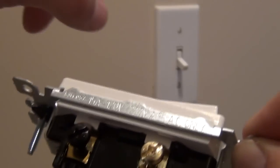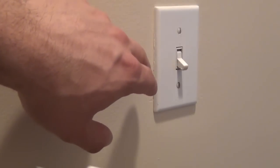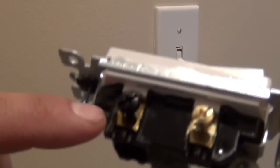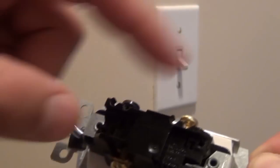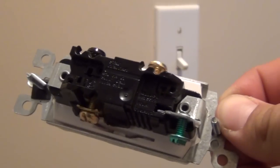When we pull this switch out, we're going to see a black screw on it as well. All we really have to remember is that the wire connected to that black screw has to be connected to the black screw on the new switch. The other two wires, which are the travelers between the two switches, can go to either of the brass screws — it doesn't matter, the switch will still work.